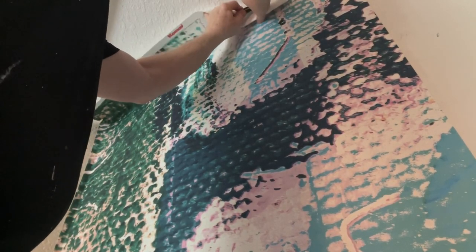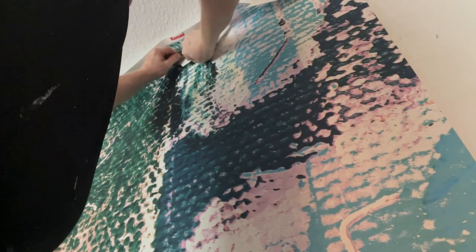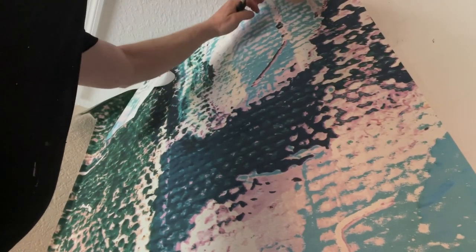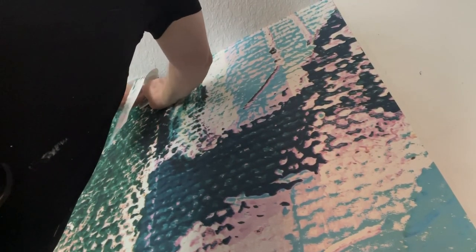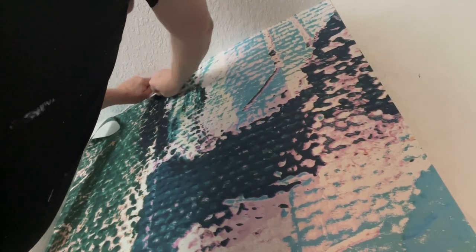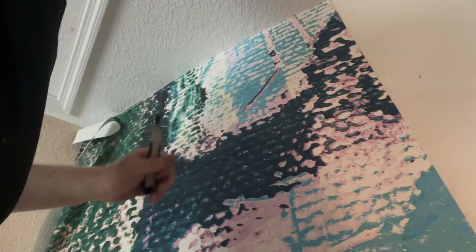When you're trimming at the top or on the bottom, on a concave or convex wall, you want to go in short spurts. The reason is because if you go in long spurts, you're going to wind up trimming too much wallpaper off. My smoother there in my right hand, you see that white thing? That's too long. It's not conforming to the curve. So I really have to drag my blade right along the end or the beginning of my smoother. If I don't, I'm going to cut off too much.